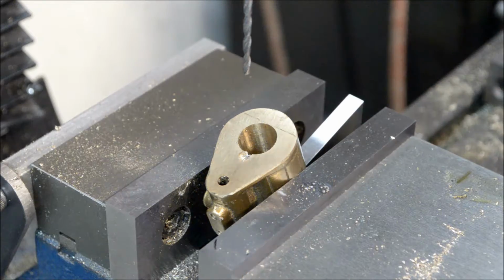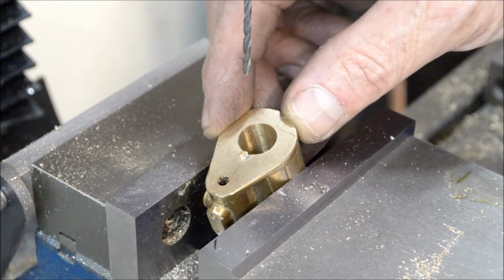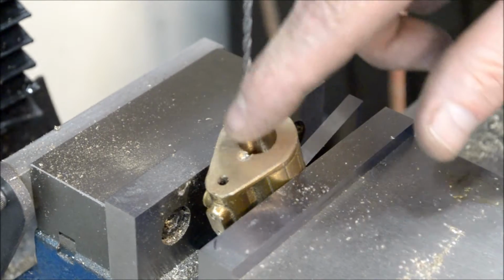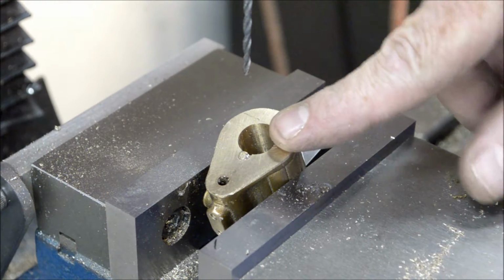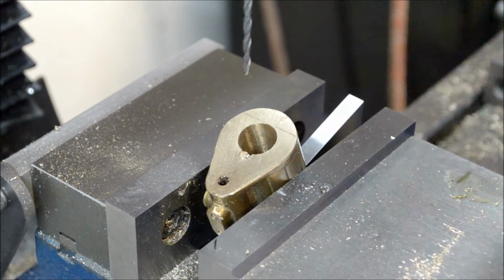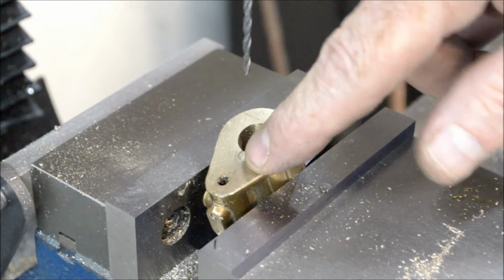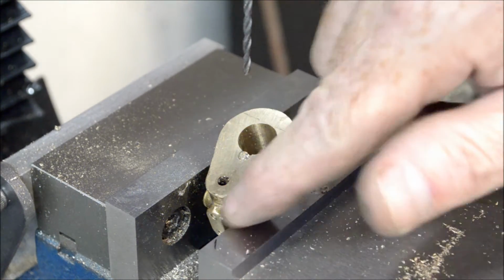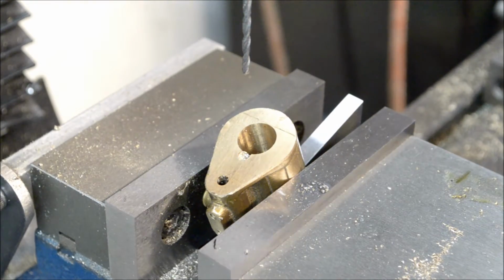Alright, well, thought I'd bring you back in here. This way we could either share the victory or share the sorrow. I have a counter bore. I have it spot drilled. I got my 3/32 drill bit back in there. And alright, as everybody knows from before, I'm going to drill down and intersect that other 3/32 port which we drilled earlier. So here goes.